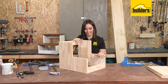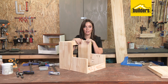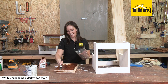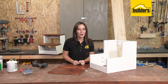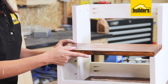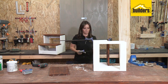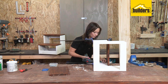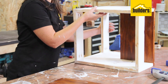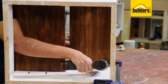This is now looking a lot more like a step stool. I'm going to attach the steps last because it's a two-tone color scheme — chalk paint in white for the bottom and a dark wood stain for the steps. The paint is now dry on the separate parts, so it's time for final assembly. Let's double check that our steps fit in perfectly — and they do. I'm going to manipulate the step stool, use some clamps for the best leverage and angle, and drive in the pocket screws. The first step is secure and in place; now we do the same to the second step.